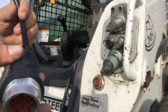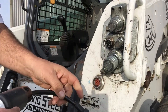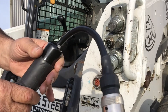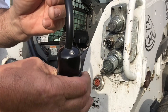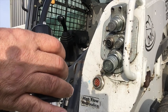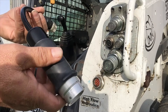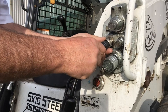Okay, let's talk about operation. You'll see it's just a plain old 14-pin here, and on this side we've got the 7-pin CAN bus. Right on the back here we actually have an LED — this is our indicator status LED and it kind of tells us what's going on inside the machine. It really helps with troubleshooting: it tells us the thing's operating properly and even gives us the status of how the controls are working. On our earlier ones we didn't have any indication, and people would say the unit doesn't work and send it back, then it would work perfectly. So we were able to identify that most of the time it's a problem with people's machines.